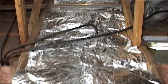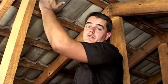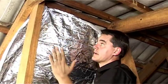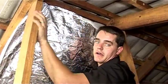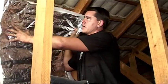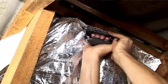In extreme temperatures, and also if there's no shade on the roof with intense amounts of heat coming into the house, we install the insulation against the roof tiles. It's important to start at the top of the roof but leave a natural air gap at the ridge so the hottest air can still channel out naturally. This is done simply by using a staple gun, positioning the material in between the roof rafters, and stapling the foil onto the inside of the roof rafters.